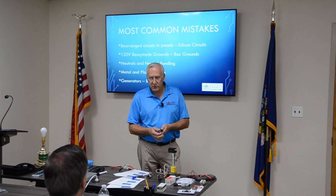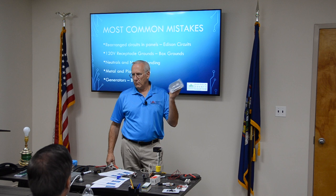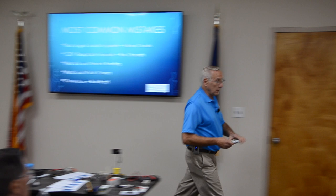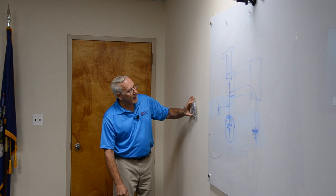Plastic covers are good for metal or plastic boxes. Metal covers are only for metal boxes because you don't want the face to somehow get energized on a piece of plaster, which is an insulator. This could be sitting there energized, and you're touching it. Where's your reference point? And then if it's attached to a metal box, you're grounded now. Well, if this thing is hanging off and it's energized and you touch it, your reference point is right there. From here, through you, down here.